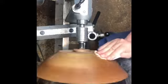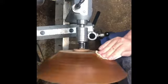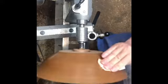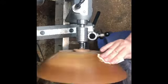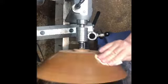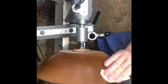I don't know about you, I find it interesting the things I discover while I'm turning. I'm sitting here with my abrasive paste working it. I don't hear the grit working anymore. That's why I've turned it up now. I'm up to 700 RPMs. Next time I turn it up, I'm gonna go to a clean spot on my paper towel.